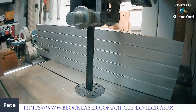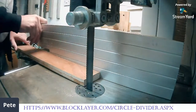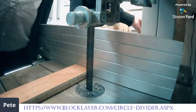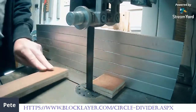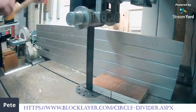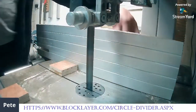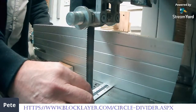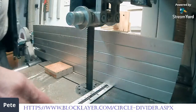I'm using two bits of 9mm ply glued together because I didn't have any 18mm. The first measurement I want is the width of the ply I'm using, so I'll shove that in there and set the fence — I want two pieces of that. I want one at 45mm to go into the groove, and one at slightly under 45mm to become my locking tab below. It could be 45, as long as it fits down through the groove, but I find taking it a mil under is better.